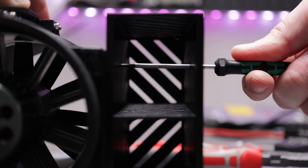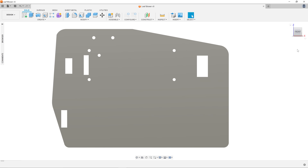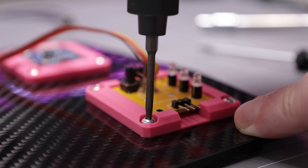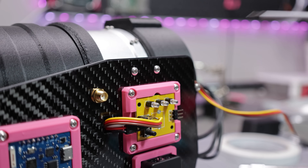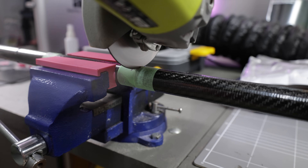A part mounts below the fan unit to house the LiPo batteries, and the side plates hold the electronics. I don't have a router to cut carbon plate, so I had to cheat a little — I found some very thin carbon twill sheet that I was able to cut using a stencil, knife, and scissors. The various bracketry housing the electrical components was attached to the side plates. The base of the cantilever handle attaches to the chassis using a fastener, and I used 25mm carbon fibre tube that I had laying around as the handle.